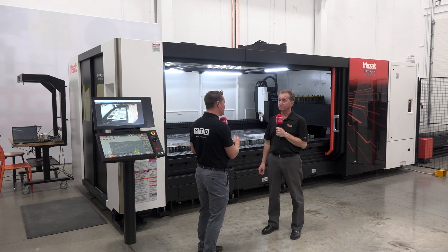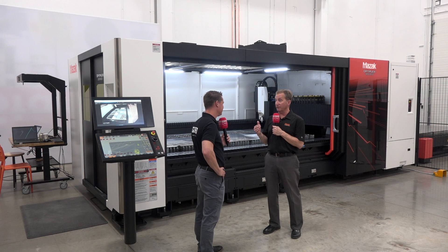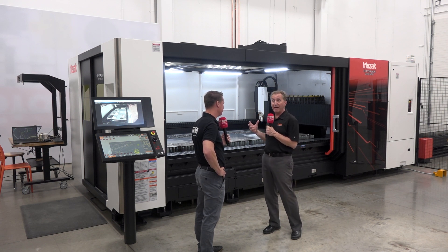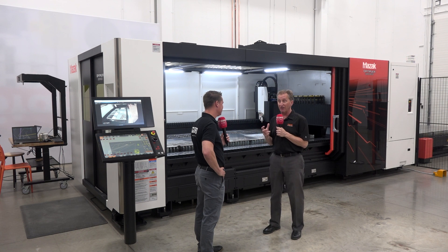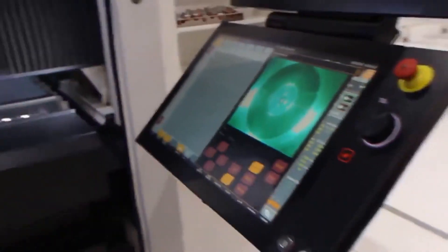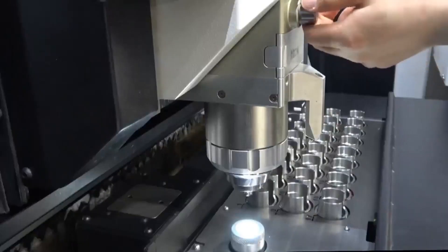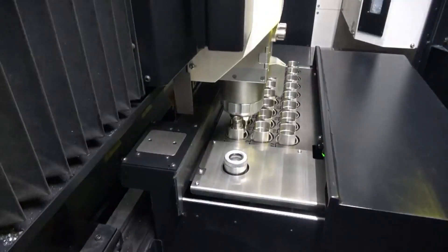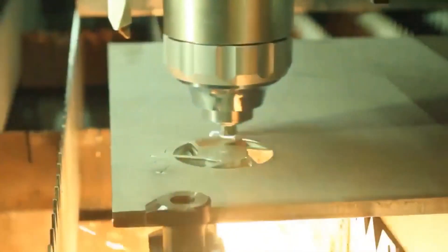So now we're talking about 50 millimeter of thickness, but we're not sacrificing the flexibility. What are some of the options on this machine where we say the customer can do whatever they want? Traditional fiber lasers have been able to deliver a high power laser beam, but essentially with one heat profile. With the NIO platform, we have proprietary technology that allows us to control not only beam diameter and wattage of power, but also concentrate where that power goes in the total array of the laser beam. So we're actually balancing power distribution in the beam itself.